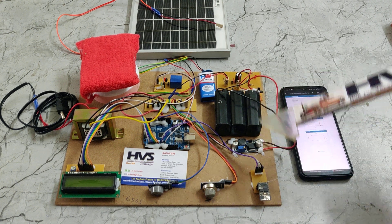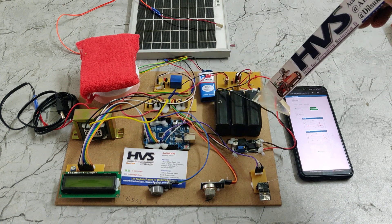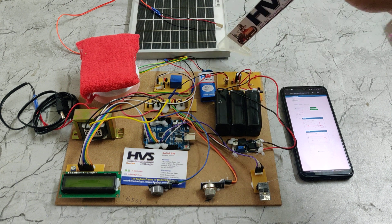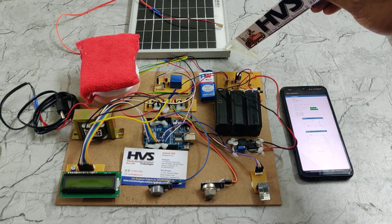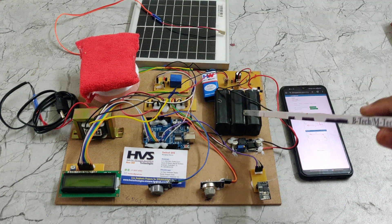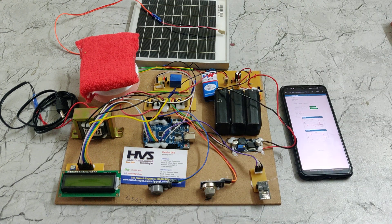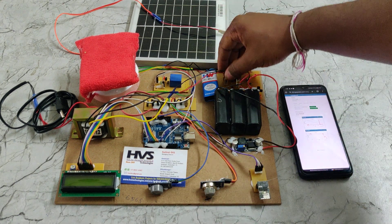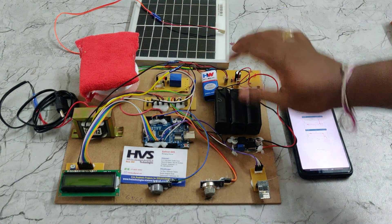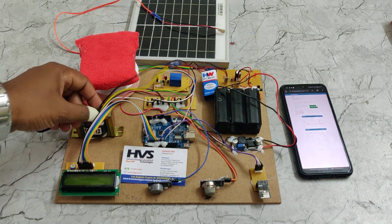All these systems will get power supply from a 12V 1A DC rechargeable battery, which is recharged using a solar panel rated at 12V 5W. It will take around 5 to 6 hours to fully charge when getting full sunlight from the solar panel. Whenever sunlight is not available, we can recharge this battery with the help of a transformer — that is, grid power supply.